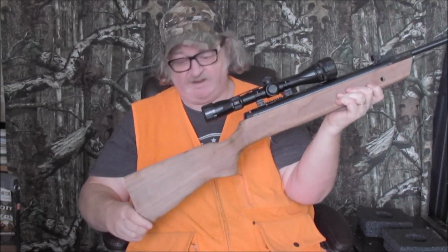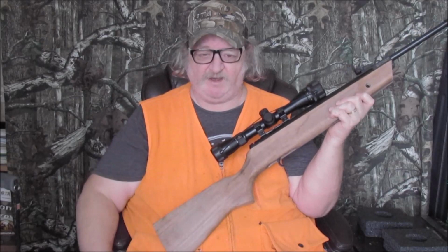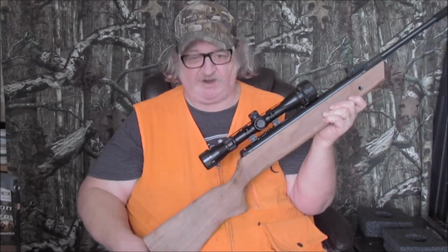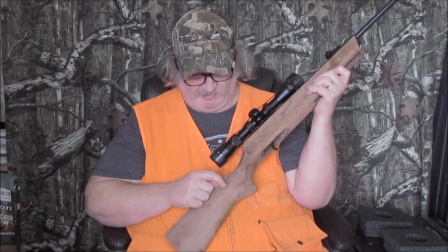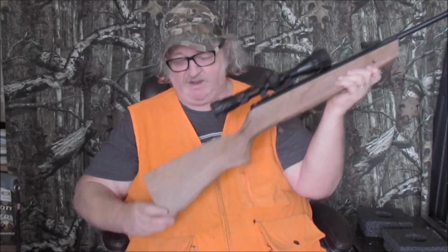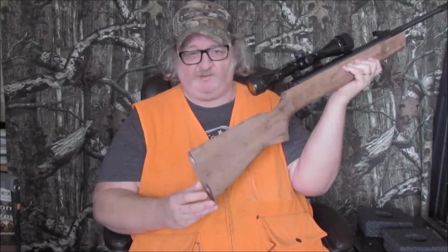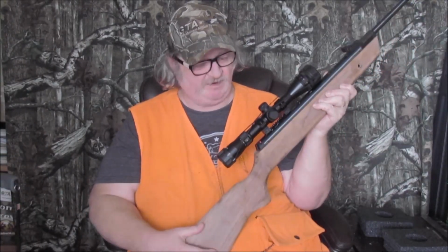But looking pretty good. You know, where the darker spots are from finger handling and, you know, the greasy cooking air in the kitchen floating around the house, and everything settles on the wood and starts aging again, so you gotta sand it down again. I'll also get out my checkering tools and redo this border right here to sharpen that up from sanding and all. And unfortunately, the 1000X red, white, and black butt pad and plates don't fit this one. They stop about that short. This is a little wider back here, even though it doesn't have the Monte Carlo cheek piece.